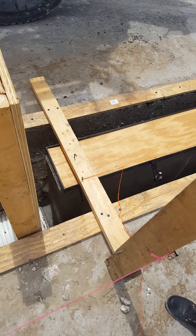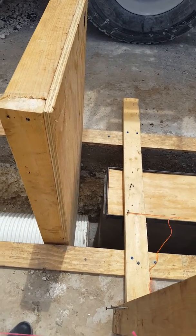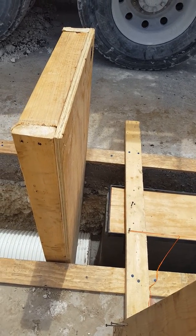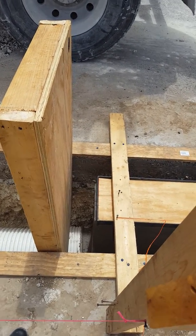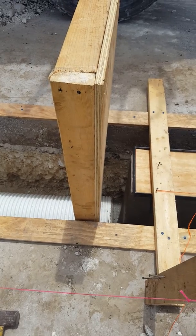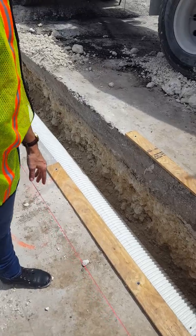We put a pipe stub out there and adapted to the contact pipe by fiberglassing it on — we used resin, paste, and cloth and just fabricated it out here in the field. Typically we would ship it with an SDR 35 outlet and the customer would connect to ADS pipe or contact pipe or whatever they want. But here we pushed the contact pipe right up against our pipe stub, wrapped fiberglass cloth and resin around it, and it's a solid seal.